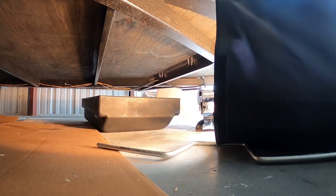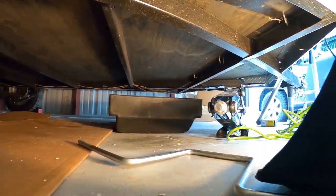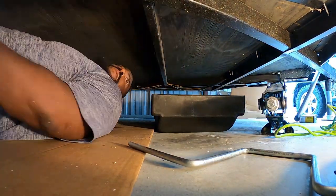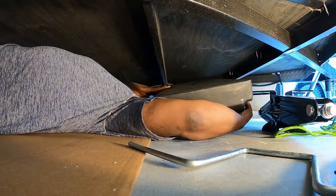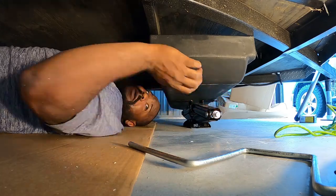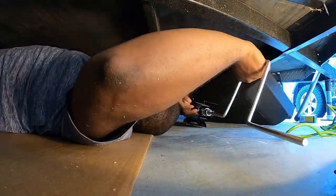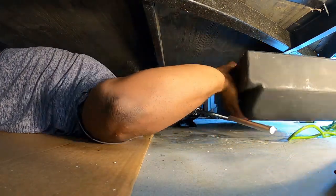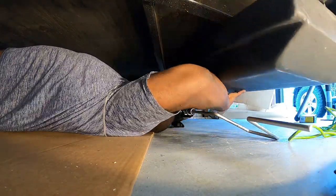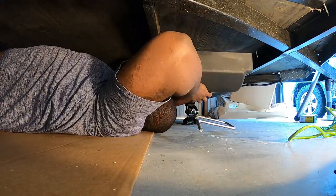I initially bought the wrong drill. I think I bought a 4 1/8 inch drill bit, or it was 4 1/4, but I really need a bit bigger than that. So later on, when I drill the hole for the black tank, I have to come behind it with a jigsaw and increase the opening a bit, because the main part of the flange is only around 4 inches, but there's a beveled lip on the flange that comes out maybe another quarter inch. So I had to use the jigsaw so the flange can sit flush on the floor.